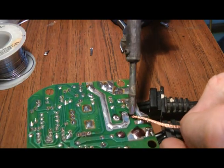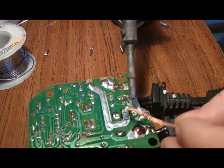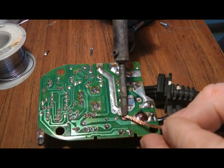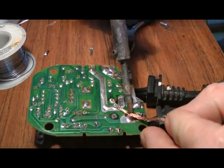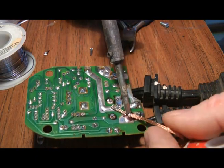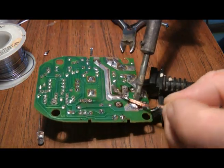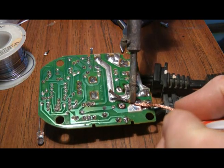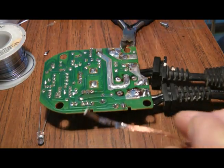Go ahead and do the third one. We've got two more to do. And if I do it instead of talk, it doesn't take a lot of time. Okay, solder's coming out — see, I see the solder running up into the wick. Instead of cutting off, you just skip. That's got a lot of solder on it, that's going to be hard to take off. That's a lot of solder. Got a little crazy on that one. What we may have to do on that one — which is why they use the solder suckers — you can pull huge amounts of solder off with the solder sucker.